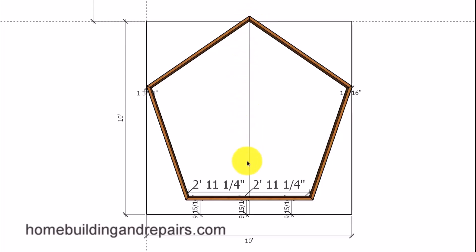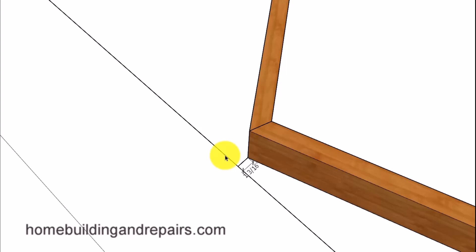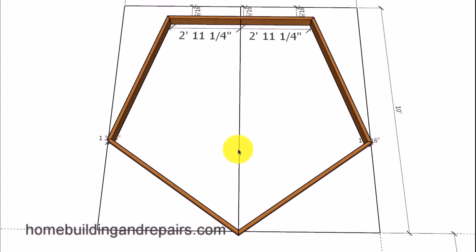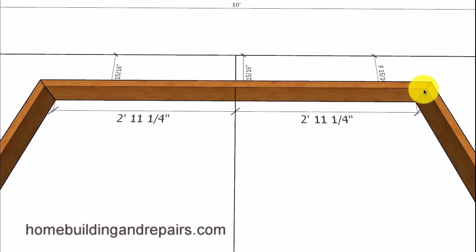Hopefully the position of the pentagon along with the center line becomes a little clearer here, because the center line at this point will line up with the center of the angle. Down here it will line up with half of the distance of the measurement, providing another reference point to position the pentagon. If you used string lines to represent a square, you'll be able to take measurements off of it. The distance from the center will be the same on both sides, so you can line the center of this board up with the center of your string line.